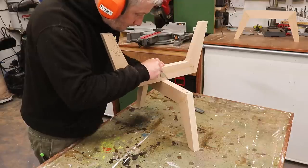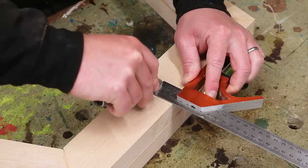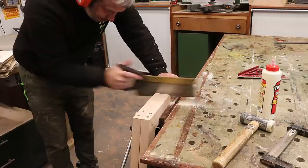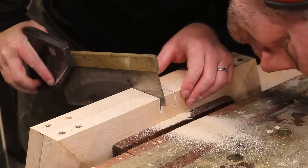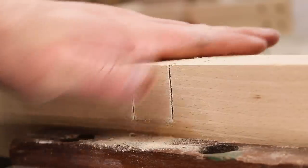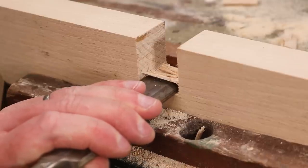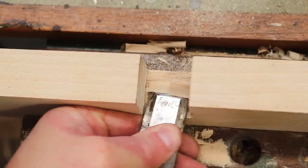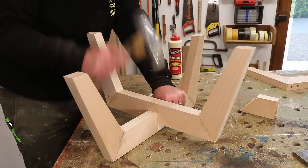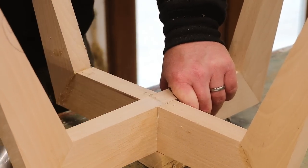I am going to do some joinery to secure the legs together — here I'm centring the legs and then using a knife to mark up where to remove material. Because I'm making a pair of nightstands I can cut these half lap joints two pieces at a time. For two of them I'm making the cut at the top of the apron rails, cutting to a depth of exactly halfway through the material using my tenon saw, then removing the bulk of the waste with a chisel and using the chisel right on the knife mark line to get it flat. For the other two I cut at the bottom of the apron rails, and as you can see they overlap and join together — they went together a little tight but I managed to get them properly seated with a few whacks from the mallet.